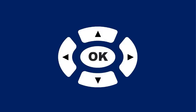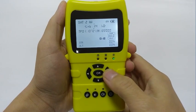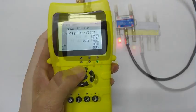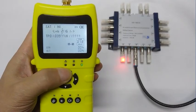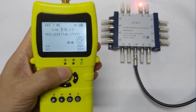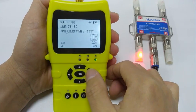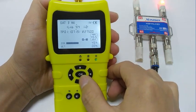What can the OK button do? This is the easiest button to press and we should let it do something to avoid waste. Here we add a new feature: DiSEqC Switch Operation. With it, this machine can be applied to a broader environment. The triangular arrows indicate the operation moved to a new position, suggesting how to operate here. Use the left and right keys to select the type of switch that the signal passes through, and use the up and down keys to select the port number for signal access. Whichever port you choose, that port will output voltage so that the corresponding LNB will work and pass the signal over. When you press OK to return to the working screen, the DiSEqC icon will still be displayed, prompting you that this satellite signal came in through a DiSEqC Switch.